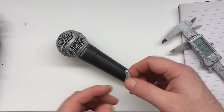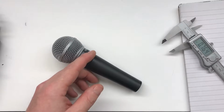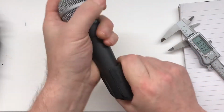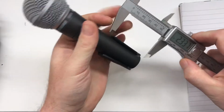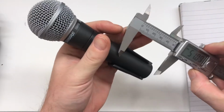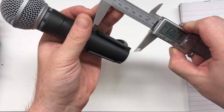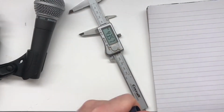I thought I'd show you the whole process from designing to drawing it to actually printing it and then putting it together. Okay, let's take some measurements. Let's put this tightly in there and we can see that we're working in millimeters, metric. Let's say that it's 55. Let's make it 60. It's gonna be 60 long. Let's draw it down.